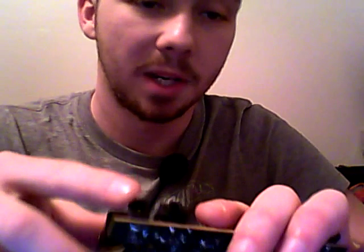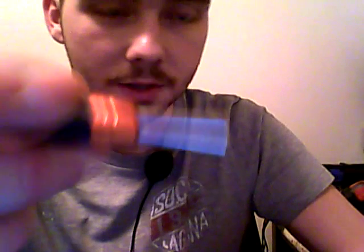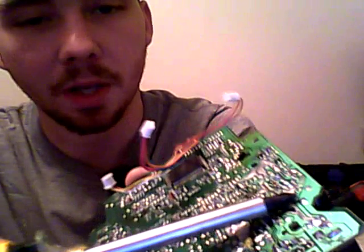Just take precaution. If you think a capacitor here is charged up and you took the thing apart and you didn't want to get shocked — the best thing to do is short out the leads from the power and short that out for about 30 seconds to discharge all the power out of the board. Or take a little screwdriver — make sure it has a rubber handle, not just all metal — take the capacitor, locate the prongs for it, and just touch both those leads together. It may make a little spark, and that will discharge the capacitor.